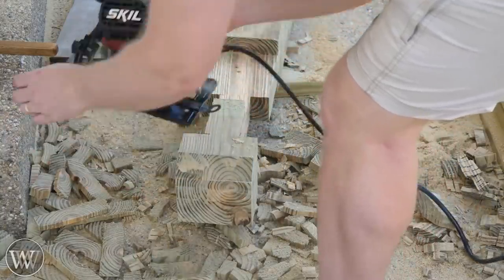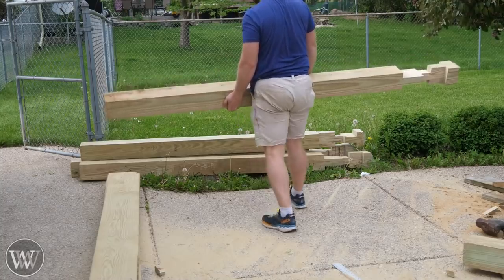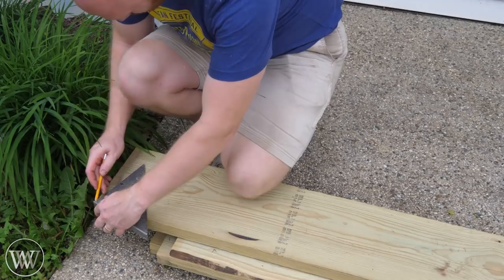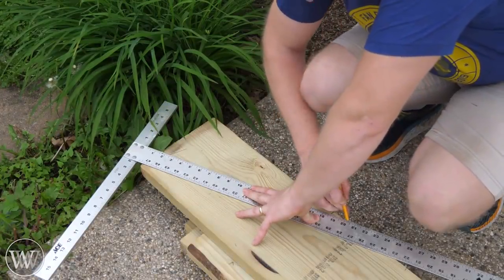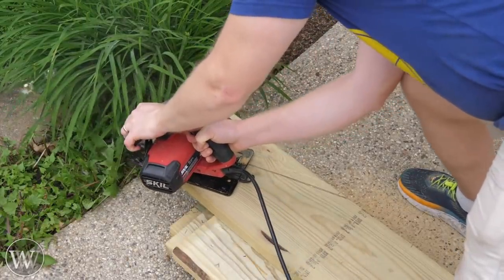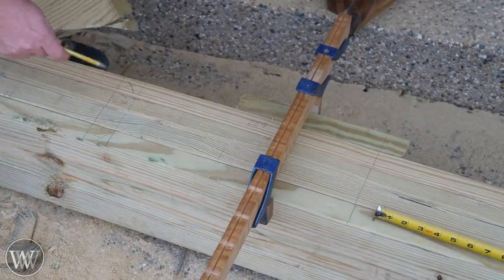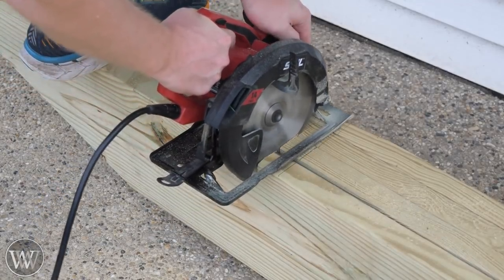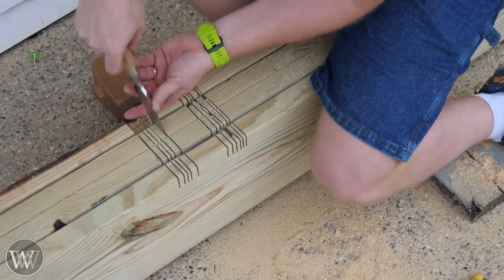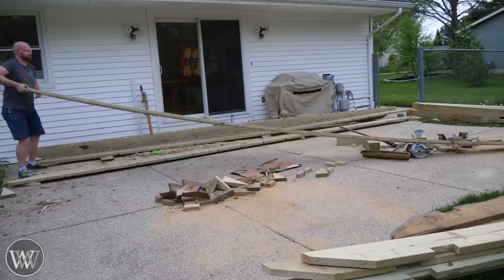I'm also going to chamfer off the top corners and make them kind of pointy, just to make them a little more decorative. Before we set these up, we actually have to cut the 2x12s as well. We're going to create an angle on those — there are 4 of these that need to get chopped up. Then we are going to be cutting 17 slots in them that the other boards will house down into. They go down 1 inch into these, and 2 inches into the other boards, so there'll be 3 inches of overlap between them. Here I made a lot of saw cuts, which makes them very easy to pop out.